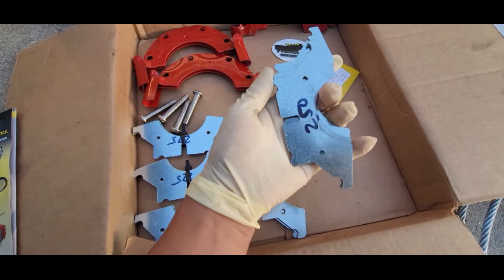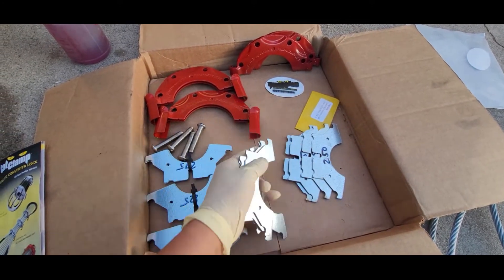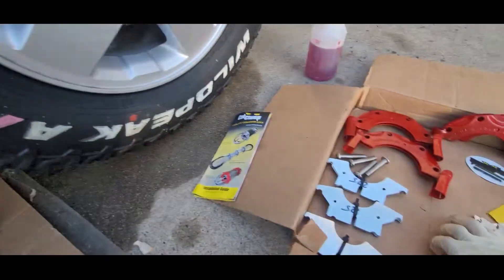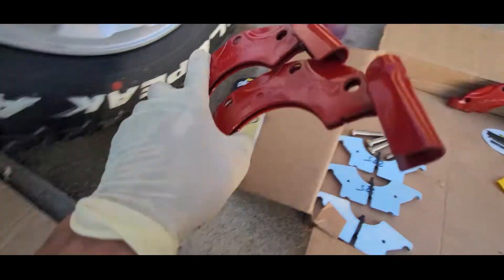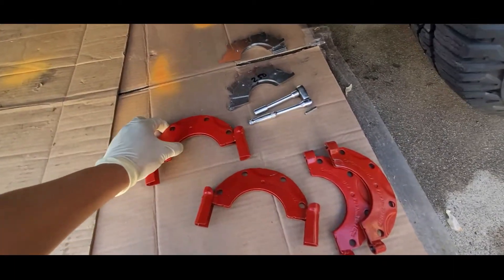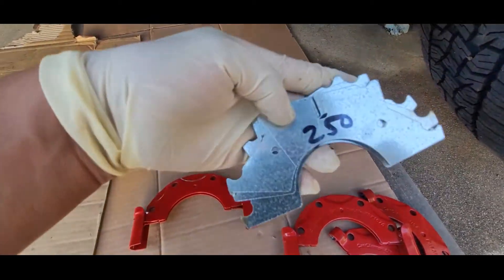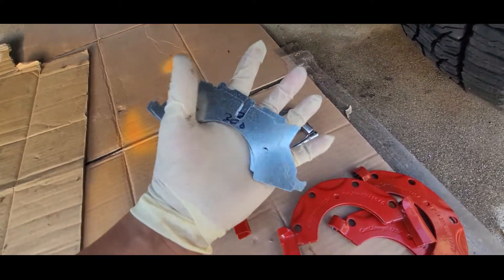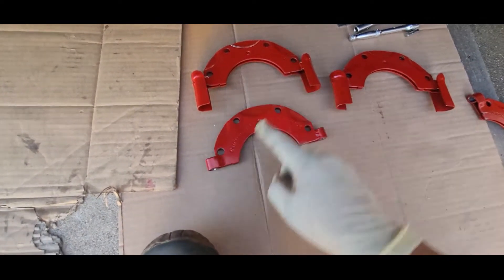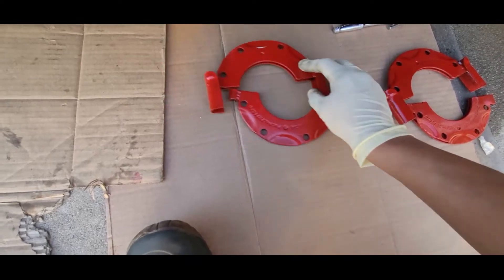To make it easier, I already know which plates I'm going to use. I'm going to use this plate here and this plate here, because there's a bigger pipe and a smaller pipe. So I'll have those ready, and we're going to use these shims. When you install, you pick the right plate — in this case this is a 250 and this says 300. I already measured before, so you need one combination for one pipe and another for the other pipe.